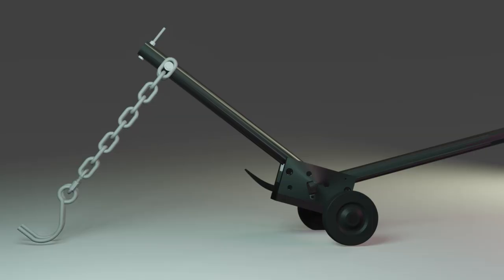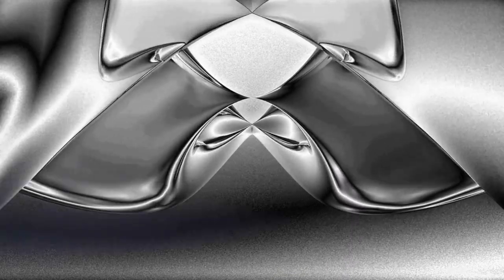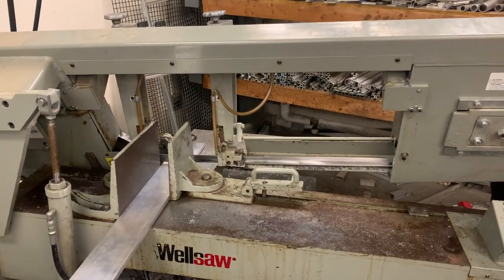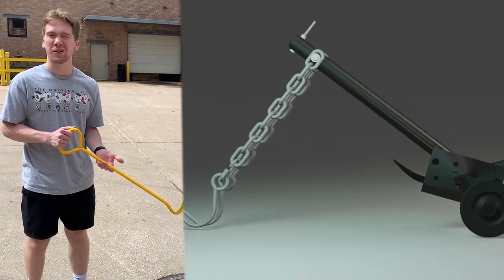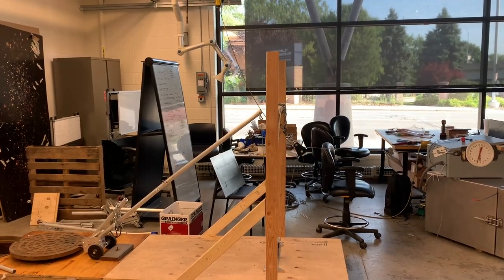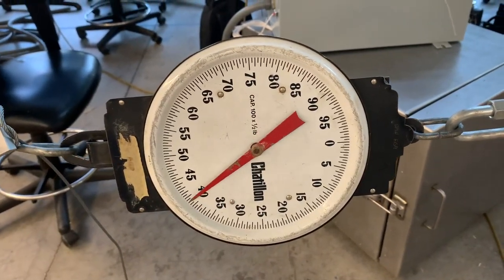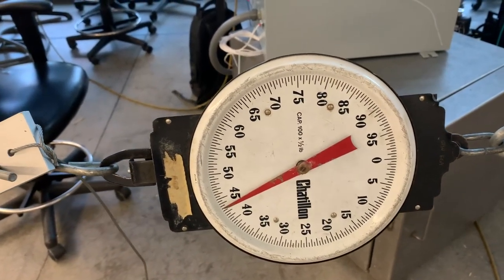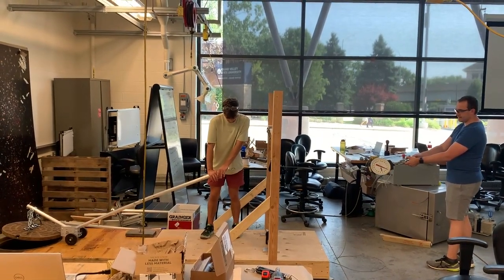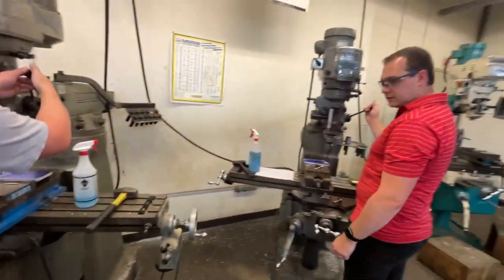Additionally, most of this assembly is made out of 6061 T6 aluminum, which has a lower density than steel and involves less weight in the overall design compared to a steel design. In comparison to the standard hex hook sold by T&T Tools, the created device incorporates much less user force overall. In fact, during testing, around a 45-pound-force load was seen for vertical lifting with a low-force forged horizontal movement. This reduces the strain of a worker, thereby creating a more ergonomic design that is easily portable, assembled on-site, and used by many individuals.